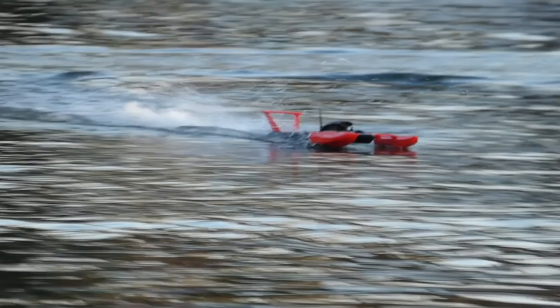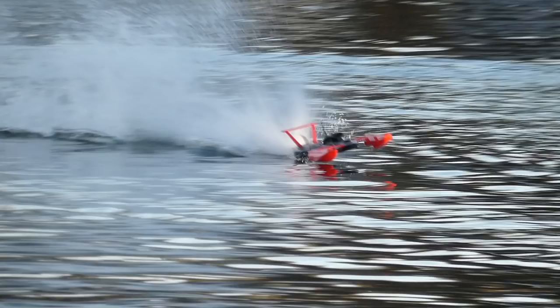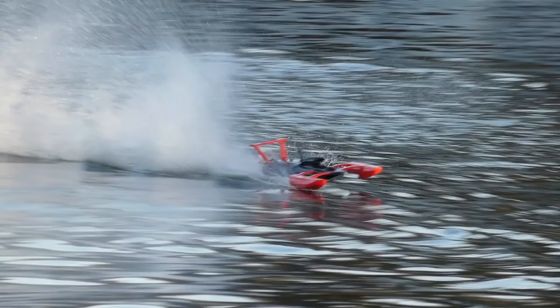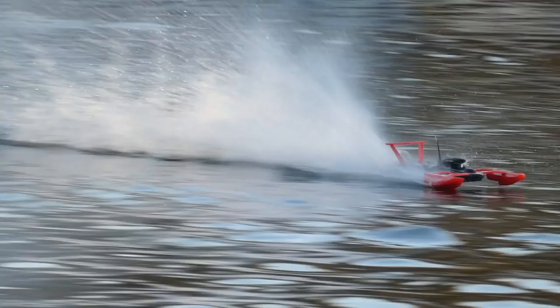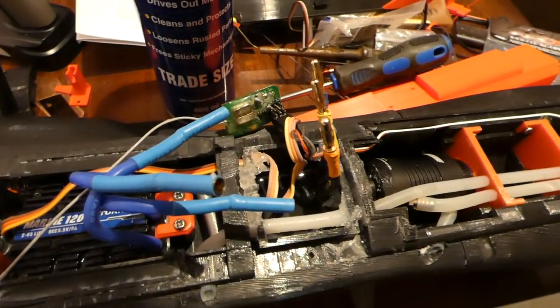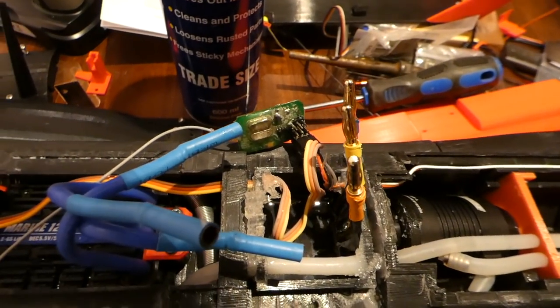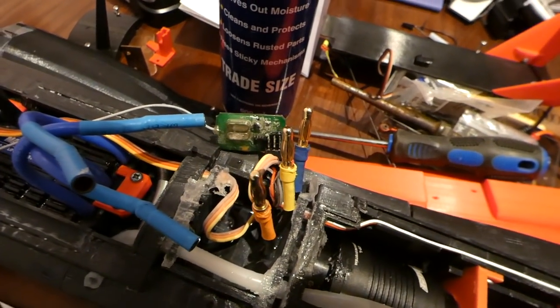At these speeds, spray gets in everywhere, and under 3G acceleration, it just forces its way into places we thought were sealed. Even an epoxy-coated radio doesn't work so reliably when water gets onto the connectors. It turns out that speed is easy. It's waterproofing that's hard. Next time I'll make the whole boat out of silicon sealant.